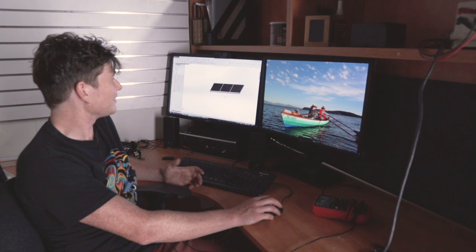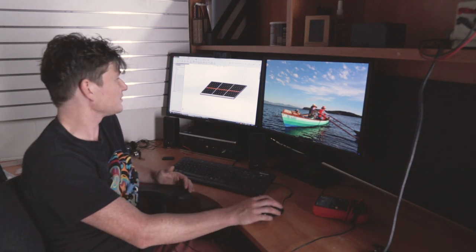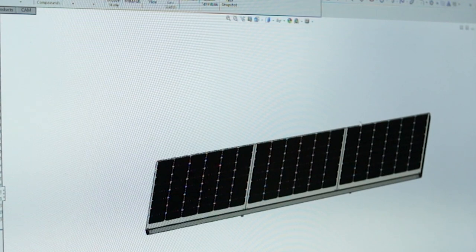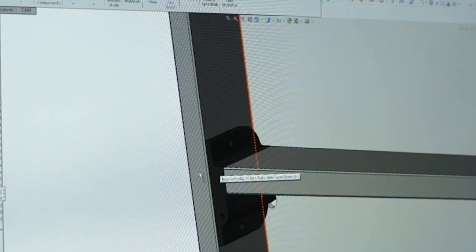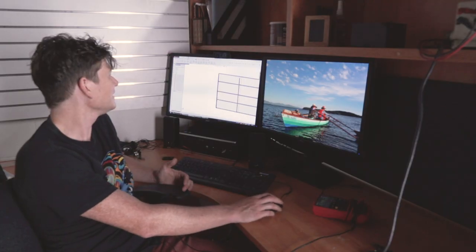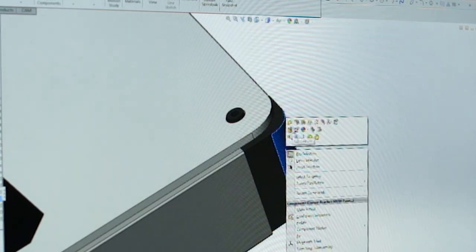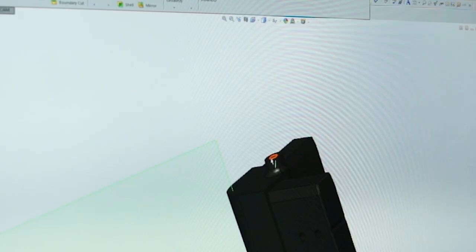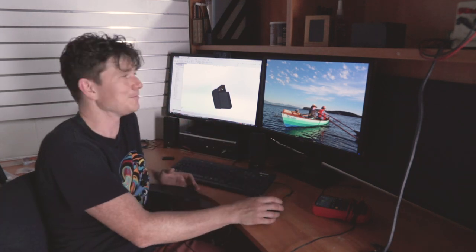For the larger 500-watt array at the back of the boat, I'm not constrained by the height of the lifeline, so we can use the larger 170-watt panels. These panels can't just be supported by the perimeter because they'll flop enormously, so I built a structure with multiple reinforcing bars spanning across it. Each reinforcing bar attaches with a 3D printed part that inserts into the end of the tube and rivets onto the crossbeam. At the corners it stuffs into both ends, and these parts have a little protrusion and standoff that lines up with the grommets on the solar panel.